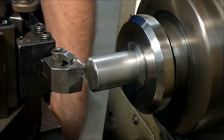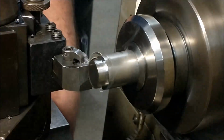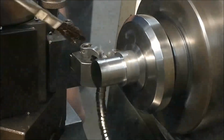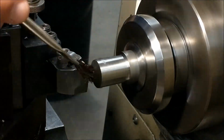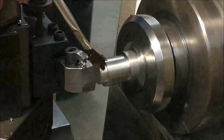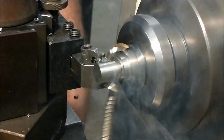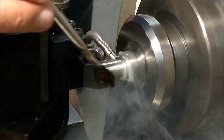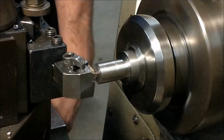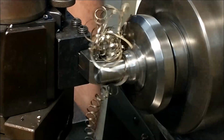The very first part of this assembly that we're going to do is the main body. And this particular diameter that I am turning is the diameter that we established was the largest gripping diameter that the chuck would grab with the jaws subsurface. If you are going to take a large, difficult material, and this is 316L stainless, so there's a little bit of resistance on this particular insert, do yourself a favor and make your first pass, once you face it off, take it to the full length that you are going to take it to.